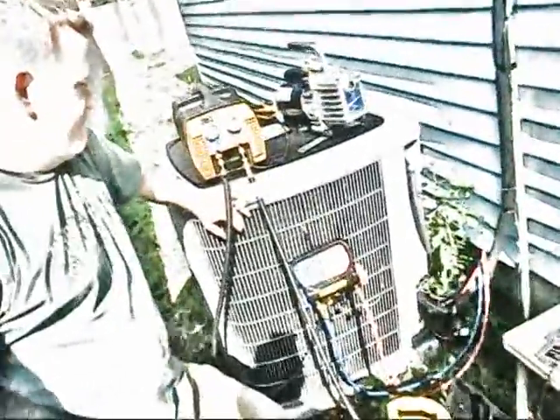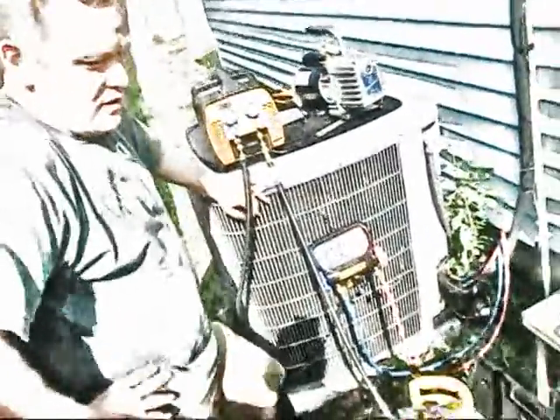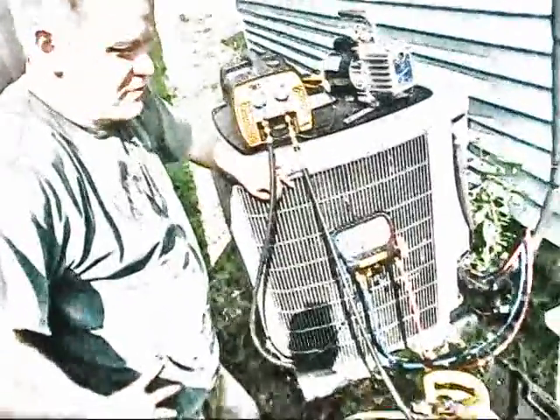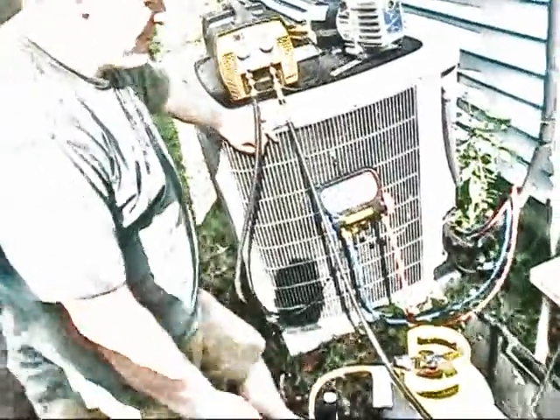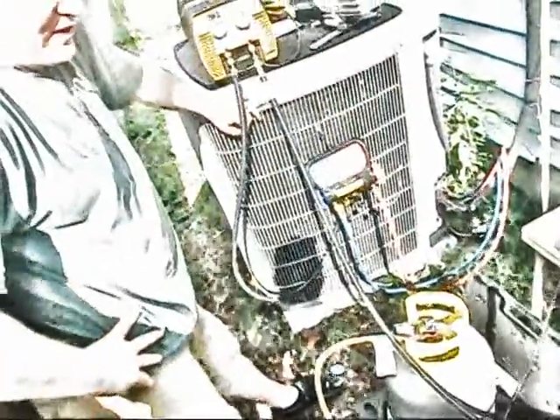I don't know, Eddie. I think this is really — on a hot day, it may make a difference. Yeah, I think it will make a difference. On a commercial job, it's really going to make a difference. Keep in mind, guys, this is R-410A that we're pulling here, so the pressures are high — right down around 390 pounds. We're at about 93 degrees on the tank. You know what — I'll use it. Why not? Yeah, I'm with you.